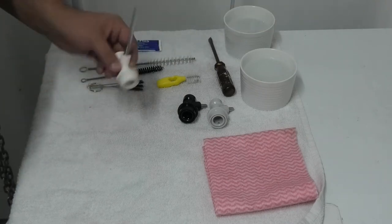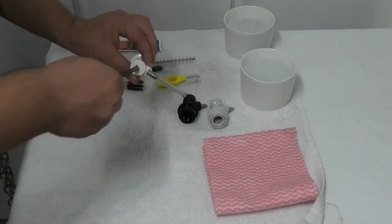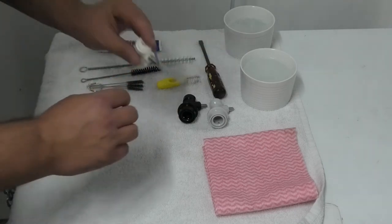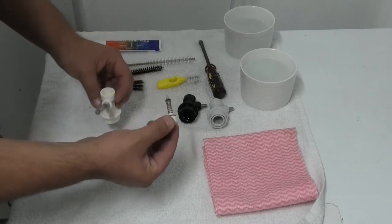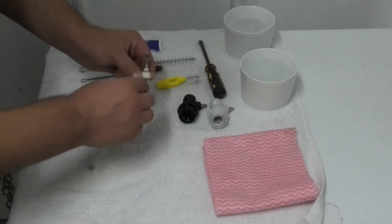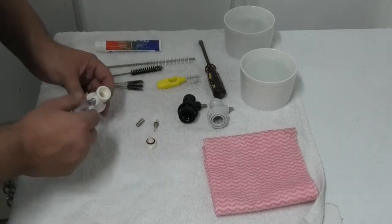So this is your basic disconnect. We're just going to insert our large flathead screwdriver into this slot on the top and then turn anti-clockwise to release the cap. Then the cap lifts out. This time the entire assembly has come with it, but sometimes that assembly may stick inside and may need to be shaken out of the body. There are three parts here: the plunger, the spring, and the cap. And of course we've got the body or housing.